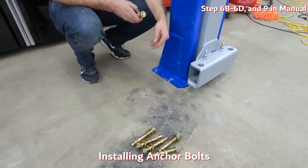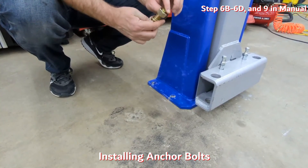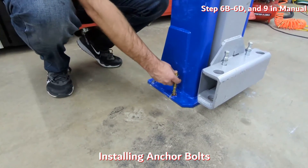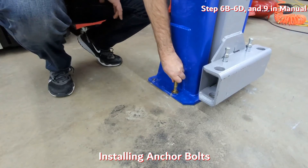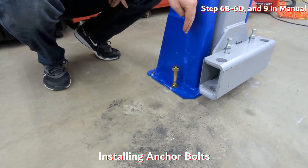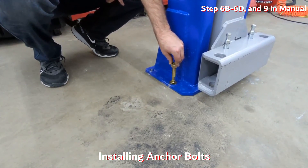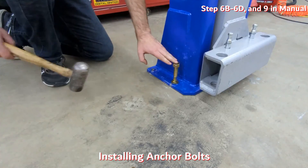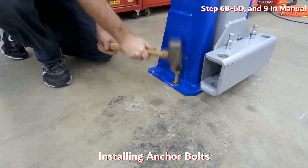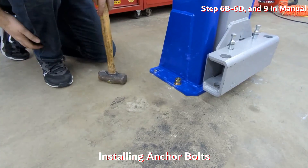You don't want any rocks or debris that could hang up on the anchors. Screw the nut just below the top of the head on these anchors, with your lock washer and washer. Insert into the bolt hole — you want a tight, pressed fit, so it shouldn't slide down. Drill the holes as straight as possible; if you get sloppy, you'll get slack and they won't be as tight a fit. Once you get them in position, slowly knock them down with a decent-size hammer.